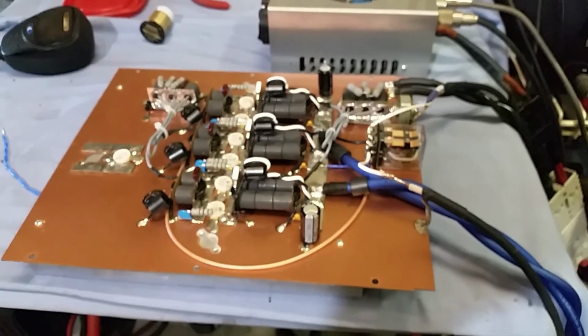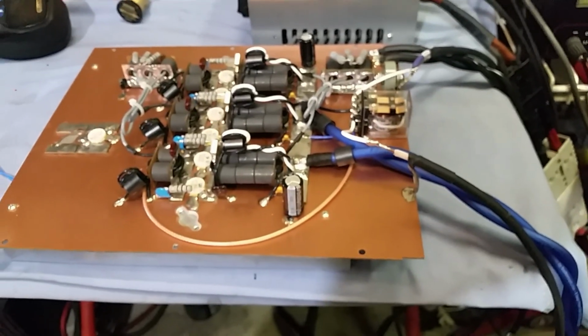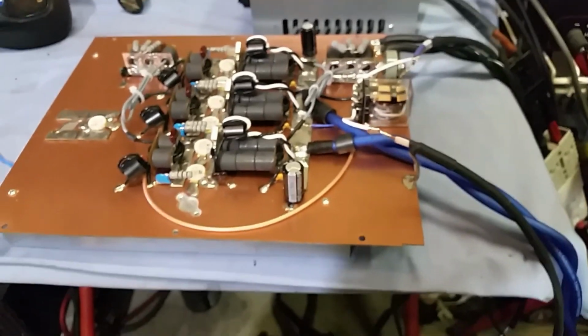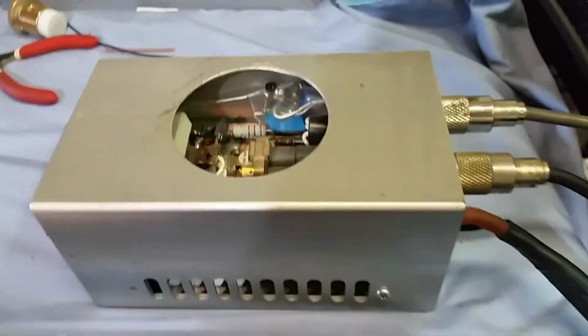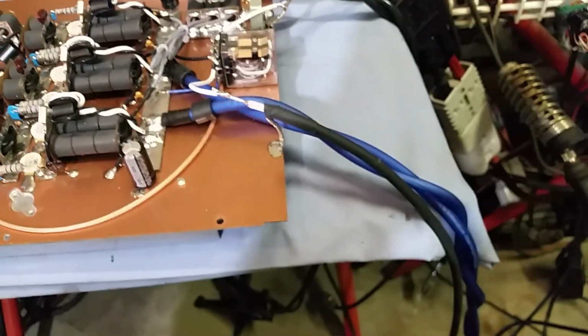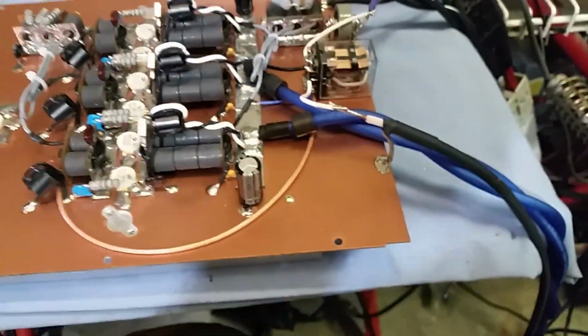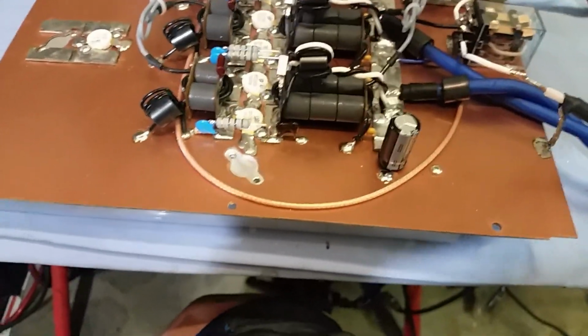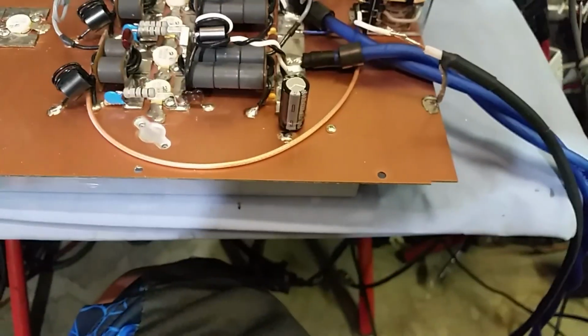Alrighty, here's the Stickman radio, which is putting double the amount RMS wise that my bench radio was putting into it, and the derail radio is putting 16 bird into the driver right here. So it was probably doing close to 1200 bird just then. A lot of you are like, how could 6 pills do it? They can if you drive the piss out of them, but I don't suggest running them like that in everyday use. If this was my box, I'd probably just run something equivalent to the bench radio, 4 or 5 bird, and just let it do about 500-600 bird and just let it roll. That's the way I like to run my stuff.